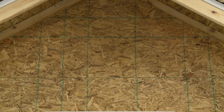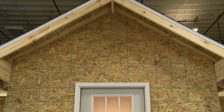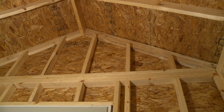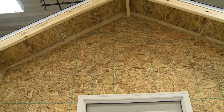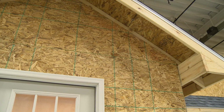When applying substrate to a gable end, it may be hard to find suitable nailing points. The probable cause is the builder's use of manufactured roof trusses. Your best solutions are to go into the attic and install additional nailers, or install a sheathing with nail-holding strength, such as 7/16 inch plywood or OSB. For extra protection, you might do a combination of both.